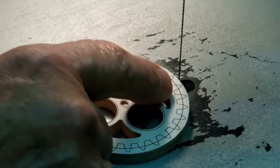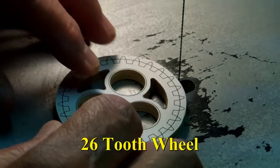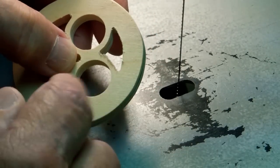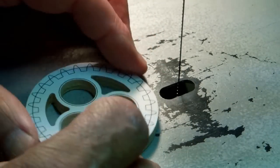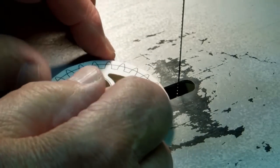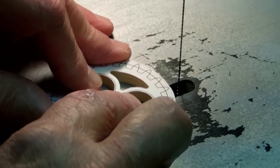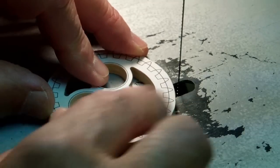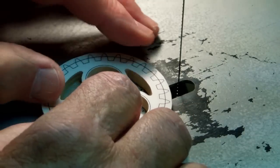These are small wheels or gears like what's used in a clock. I usually do all the inside cuts first because you're just as likely to have a problem with the plywood — when you cut one of these out the backside can blow out, sometimes the veneer is fairly brittle and will come off. When those are cut out, that gives me something to hold on to. It's a lot easier to hold on to that finger and go into one of these cut outs than if it's just a smooth disc.